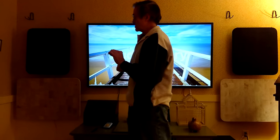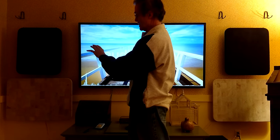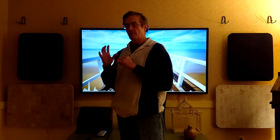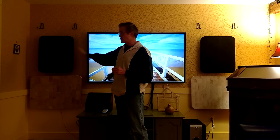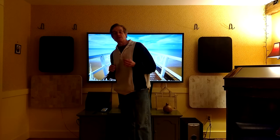These speakers right now are running a frequency range from about 130 hertz up to about 20 kilohertz. Even the very largest panels — probably 4 by 8 feet — will not produce good reproduction below about 120 hertz. So with this type of system, it's advisable to use a subwoofer crossed over at around 150 hertz, which will give you a nice, even response through the full listening range. The individual speakers, however, do not require a crossover — they achieve the crossover naturally through their materials.